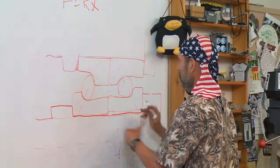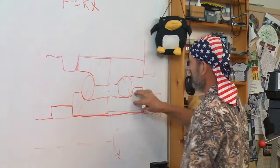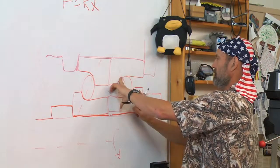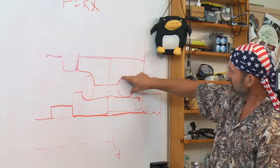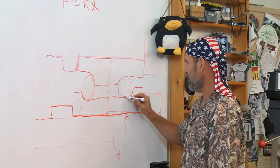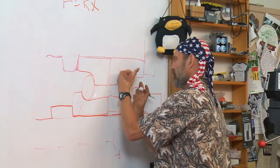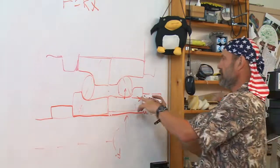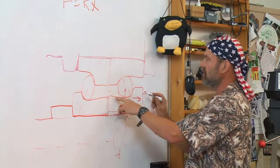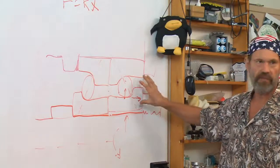When the shaft expands this way, remember these were preloaded together, they're springs, they're relaxed, and this inner ring here will want to migrate in that direction, causing the ball to become loose, because this spacing will grow and the ball can rattle. On the other hand, the shaft expands this way, and this part of the raceway expands that way, causing the gap between the rings to close to crush the ball. The expansion in a loosening axial direction cancels the expansion in the radial tightening direction. That's one of the magics of this back-to-back configuration.